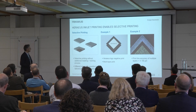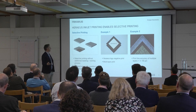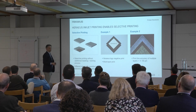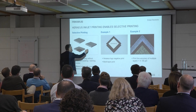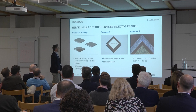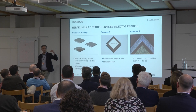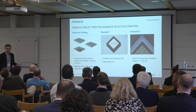These are some examples of what inkjet can do that PVD cannot. For example, if we talk about conformal coating, that's the typical way PVD does this easily. But if you want to keep an area free because your antenna or receiver is on the bottom of the SIP, then you start creating masks, special tapes, or other workarounds.